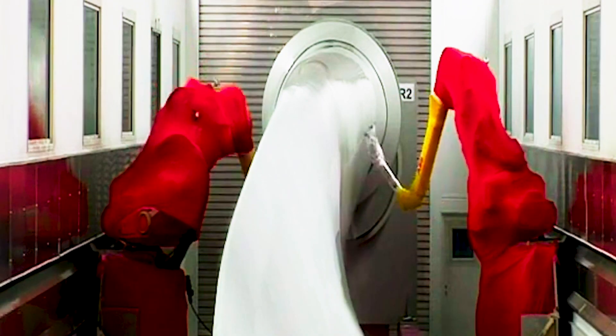Instead of reducing it as other solutions on the market tend to do, this Blade Shield system, which was developed by Gamesa, is the result of an innovative procedure for obtaining the mix, as the additive is dissolved first in the ideal dispersing agent and then in the paint base. This ultimately results in a homogenous mix that improves, even doubles, the paint's anti-erosion and durability properties.